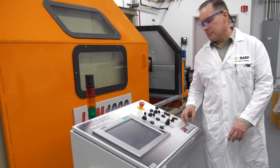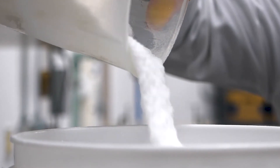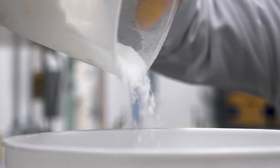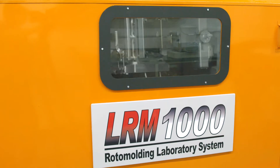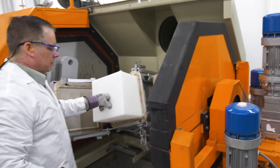This equipment produces rotational molded type articles. You take polyethylene powder that's ground up to a certain mesh size, then you heat it up on a biaxial rotation for a certain temperature and a certain time, and that cures the polyethylene. It comes out as a nice solid object with good physical properties.